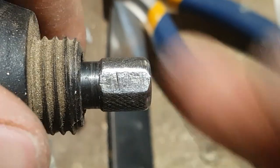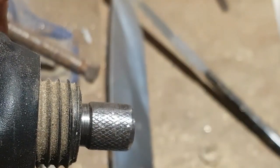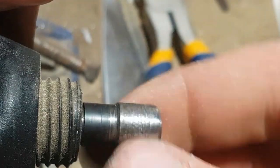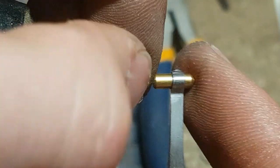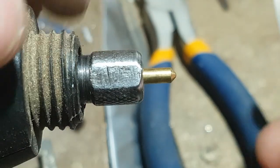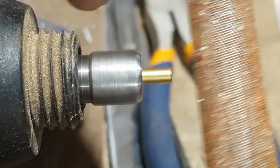The piece always stays on the drill bit so it never goes flying off, which is nice. The rest of this pin is now garbage — I only needed that top part that I cut off, which is on the drill bit. This pin requires two pins just to make one. Now I'm going to load up the second pin, which is going to become the T-pin. I should have flipped it so the pointed side was in the chuck, because this pin really only works as a key pin, not a driver.